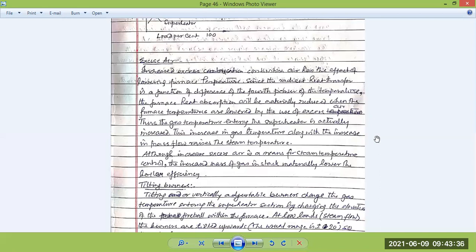Too much excess air will pump too much gas into the stack — so too much gas in the stack reduces efficiency. If excess air is supplied, the volume of gas will be mixed with this excess air, so the total volume of the mixture will be much higher. This mix goes through convective heating then goes to the stack. The recirculation cannot recirculate the maximum amount of gas — it just goes up to the atmosphere, wasting energy. That is the deficiency reducing the boiler's efficiency.